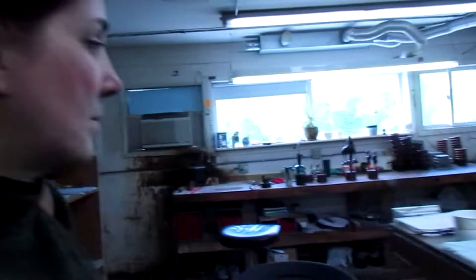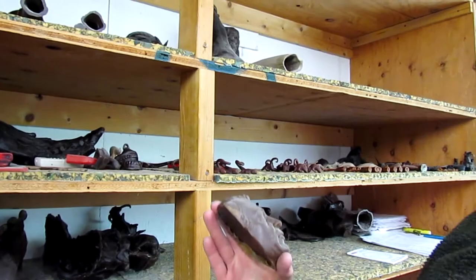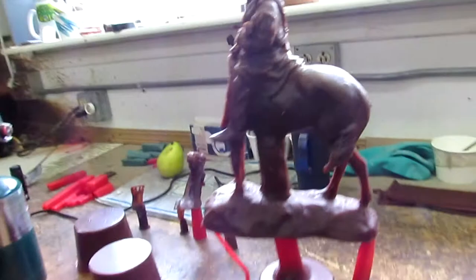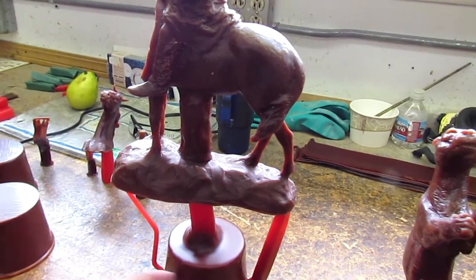You can see over here this table where Jeff works. That's a really nice face — oh, that's Gary Cooper! I did do that one. That was from the Gary Cooper bronze they used to give out. And this little clay I showed you upstairs — look at that! Anyway, they put these vents on — this is where the bronze flows in at the lower part, and this is the vent so the gases can come out, no bubbles.